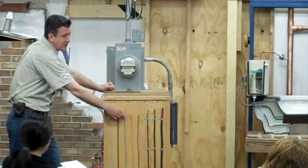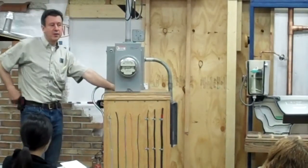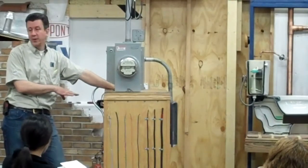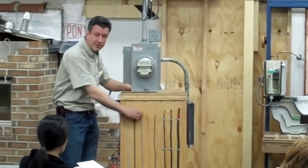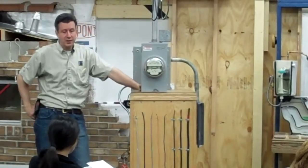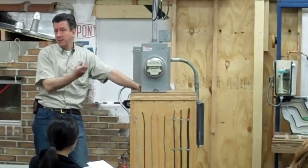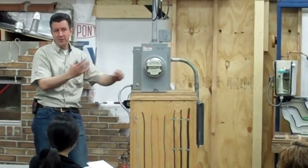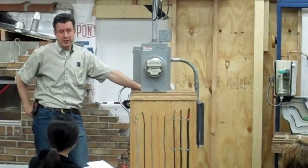So somebody who comes in and puts in the 20 amp fuse where it should have the 15, that could be allowing that wiring, it might not be in this spot, it could be at a junction where you have two wires connected. The wires are spliced, that's a weak point, and maybe it'll melt that connector that's on there. And then you have arcing within that metal and you can have a fire.